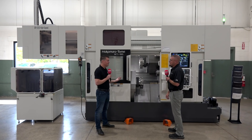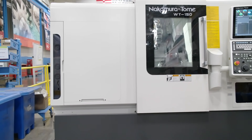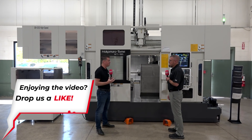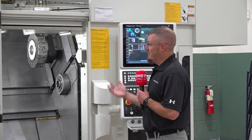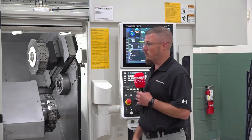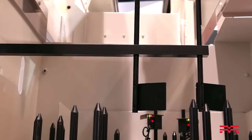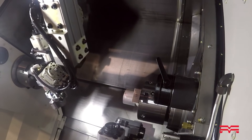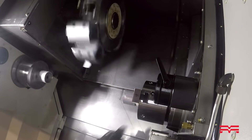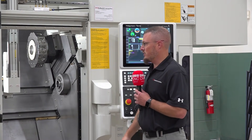What I'm gathering from this, Jeremy, is that it's pretty flexible — this allows us to do multiple projects at one time. We can add a bar feed, we can maybe add something that'll measure the parts when they come off on a robot on the other side, but we also have this gantry on top which allows for maybe a smaller footprint for people who are struggling with real estate. It's a good entry-level automation system. A lot of people are afraid of those little yellow guys that are typically mounted to the floor and fly around. This is all integrated right into the control. You simply move it with a pendant to where you want, record, and you're already programmed. So it's very flexible — you can set up multiple different jobs: a bar feed job or maybe different blank sizes. You could have different types of incoming conveyors or stockers — pretty much sky's the limit.